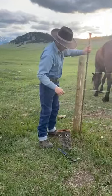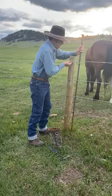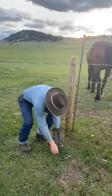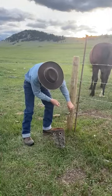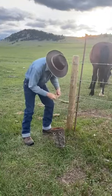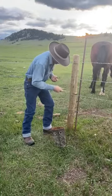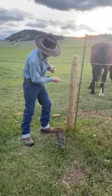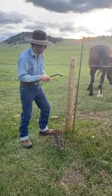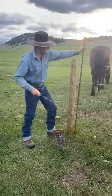You just stick it on that side of the wire, put your wires up, then hands-free your wires are in the right spot. You can just go ahead without having to hold the wires or anything, throw some staples in, and all your wires are at the correct height.